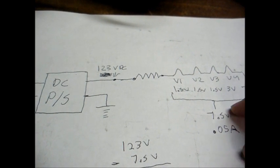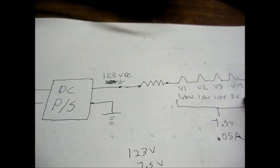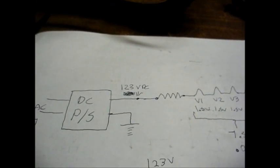Generally, they had 4 or 5 tubes rated at 6.3 volts wired in series. In some cases, there might be one 25 volt tube in the mix, but anyway, you still needed a resistor to drop the excess voltage so the tube filaments wouldn't burn up.